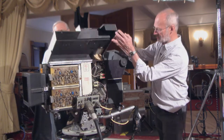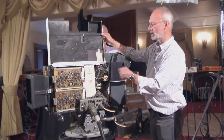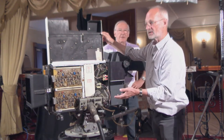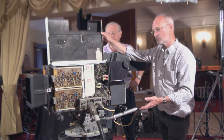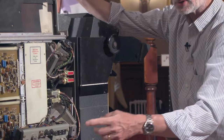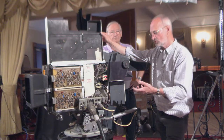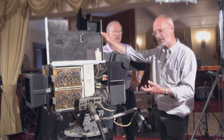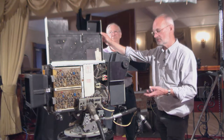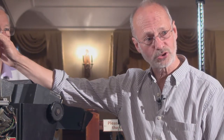If they didn't work, you had boxes of spare boards — all these boards slide out, so you'd have spare sets. You'd do it by logical fault finding: if the camera didn't work, the fault could be on the camera, a faulty cable, or something in the truck. The G101 cable — a massive cable with 101 connectors carrying mains and all sorts — was rigged through fields and was prone to problems with dirt, rain, and wet conditions. Cables were the biggest problem. It was very time-consuming, but you had more lead time in rigging because you had more problems to deal with. Now you get the camera out of the box, switch it on, and ten minutes later you could record decent pictures.